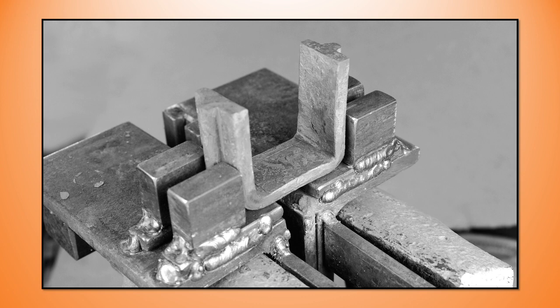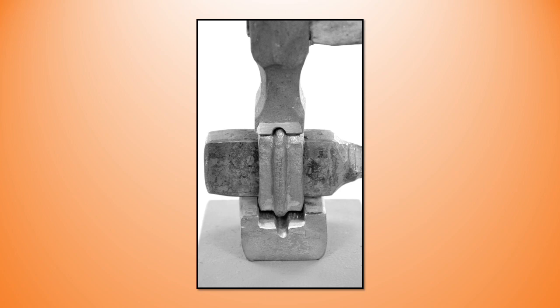As a working method, for me, I like to make a mandrel that is the same size as the Grille, including all the gaps. And if my distance here between the two sides of the collar at this stage is far in excess of my needs, I'm not talking about a 32nd or a 16th, I'm talking 1/8 of an inch or so, then here's how I shrink my too wide collar stock.